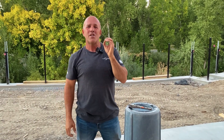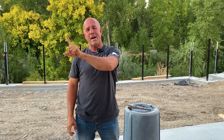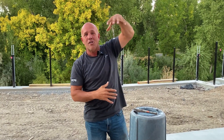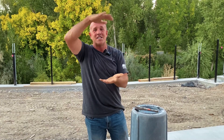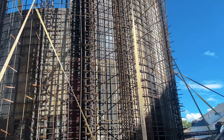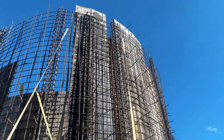To give you an idea of how strong — how much rebar we put on each side of the window — the bond beam on each side of the window is the same call-out for my rebar span over my garage that spans 20 feet across the top of my garage door, which has a concrete lid also holding the pool deck, pavers, a patio, an entire roof, and cabana on top of it. That's how much rebar spanning 20 feet is what ended up going to span only four feet in a window, and we had to put them on two sides of every window, then belly wrap them on top and bottom to make sure it couldn't bow out.